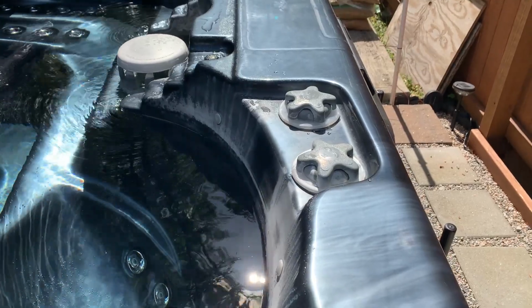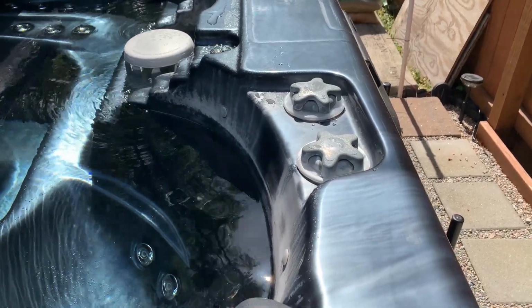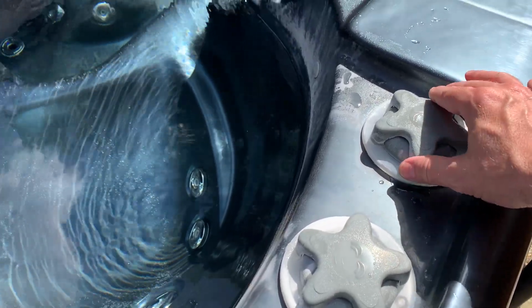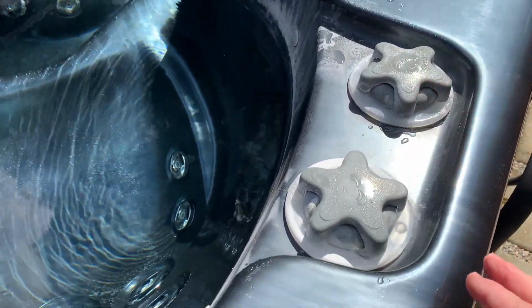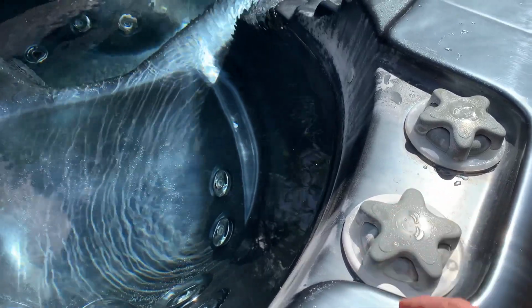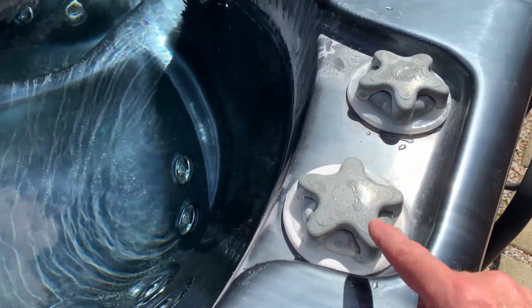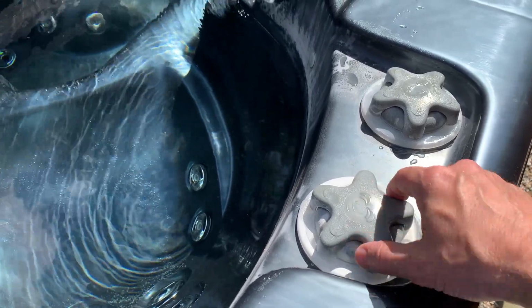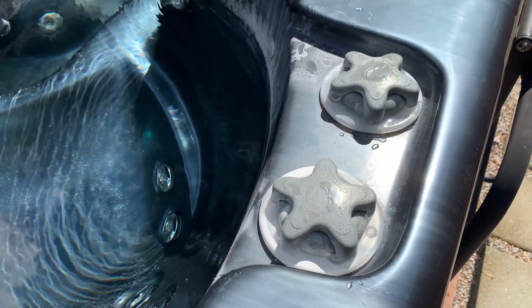We've got a video today on our hot tub, dealing with adjusting the caps on top here, the little knobs, and the caps underneath for proper tension, to allow you to divert your valves or turn your valves on and off easily without damaging the diverter valve stem underneath or breaking the cap itself. So let's dive into it.